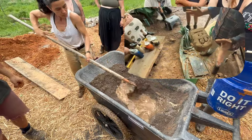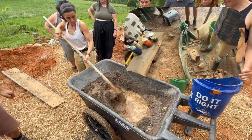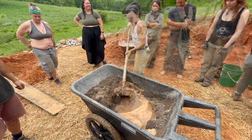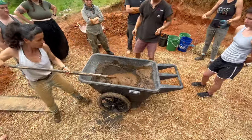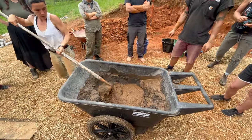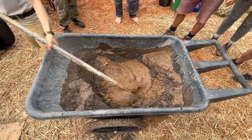As a basic guideline though, we found our strongest COB brick to be a mixture of 3 sand to 1 clay, and we then doubled the sand in our earthen floor ratio because your floor needs to have a stronger compressive strength. In this mix, the sand and gravel are our structural elements, the clay soil bonds the mix together, and the straw helps to create added tensile strength.